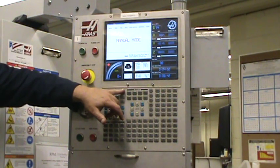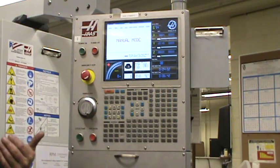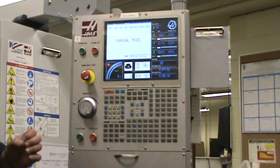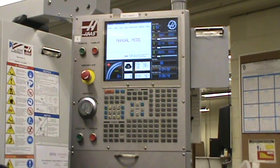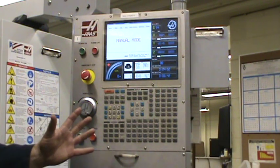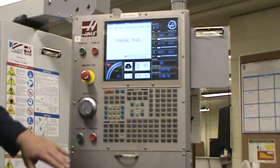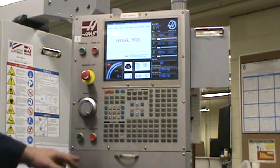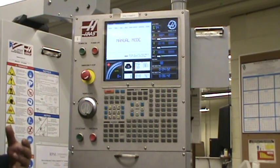The recovery button you're going to need if for some reason you stop the machine in the middle of a tool change. So once a machine's doing a tool change, let it go through and complete the tool change. Unless you see something wrong — like there's a tool in the pocket that it's going into — hit either E-stop, cycle hold, or feed hold. But you do not want to try to stop the machine during a tool change.